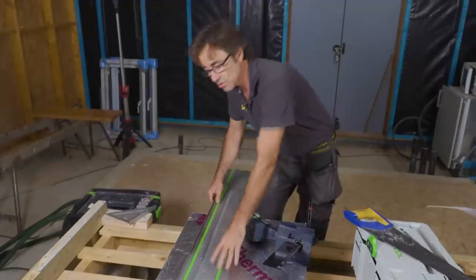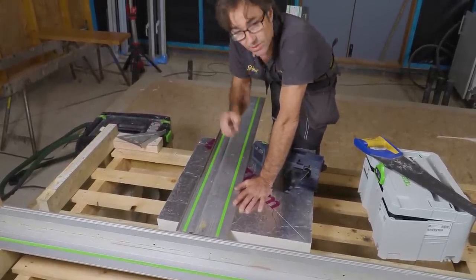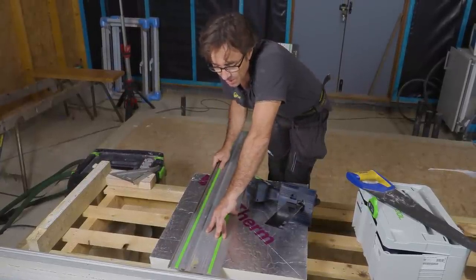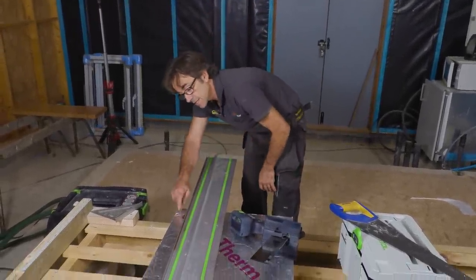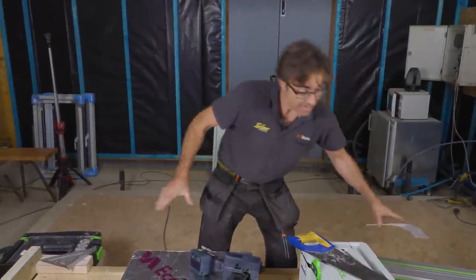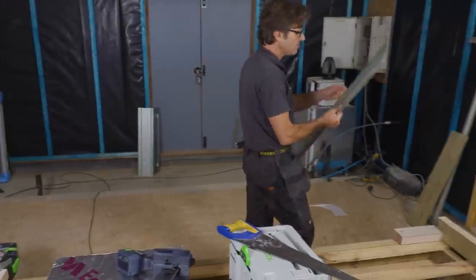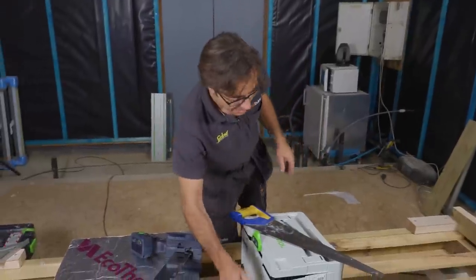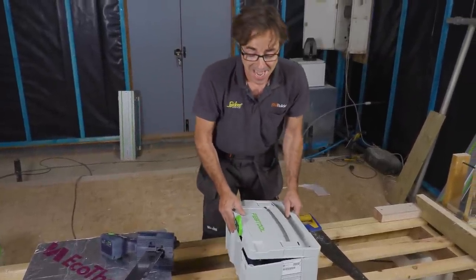It is a bit about getting used to pressing it down and supporting it. I've considered popping a couple of holes through here and pushing pins or nails through to puncture the insulation, which might hold it better, but I still wouldn't rely on that. The clamps that come with these rails can't really clamp into this material — it's quite soft. So what have I done to make it much more effective? I've made up a very simple cutting table, because I'm doing lots of long rips down the lengths of the boards. I've modified some of my rails — older ones that have a little nick or some damage — and up-cycled them for my table.